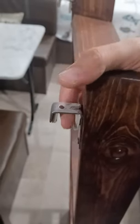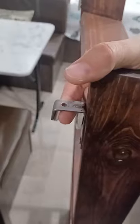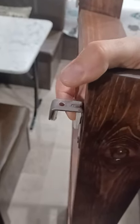it to this angle. And I put in these felt pads you can pick up at any hardware store, or at Walmart. They're really sturdy. I glued them into place and they're exactly the right fit. So it goes right onto the bunk itself and it holds right in place. It doesn't wiggle at all. The reason I put the felt in there was, A, I wanted it to be secure, and also I didn't want it to scratch the surface of these boards, because I think these are just some sort of laminate. I'm not sure, but I don't want to make deep scratches in this as people are putting the ladder up and down or sliding it across or anything like that.